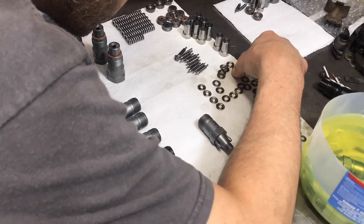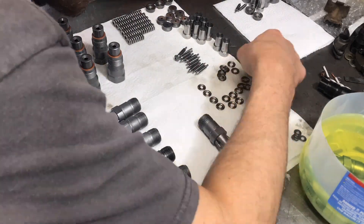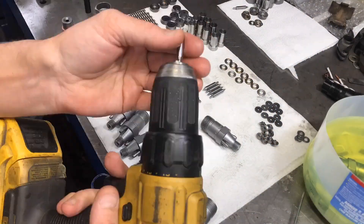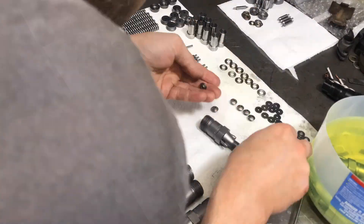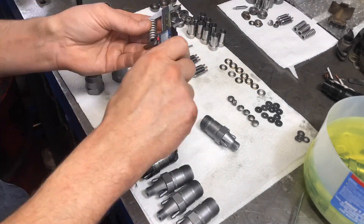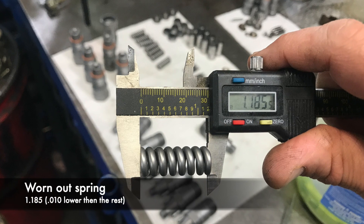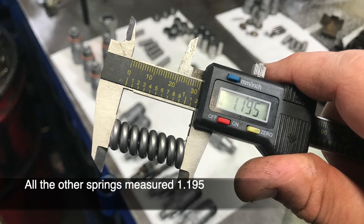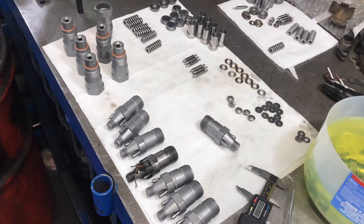My first thought was consistency in parts. Since I have such a variety from different manufacturers, I wanted to keep the washers the same — there are two different profiles. I measured all the shim thicknesses, all the spring heights (I even found one that was lower than the others), and the seat thicknesses that go in the middle of the springs, including the one for the pressure sensor.